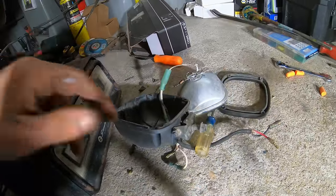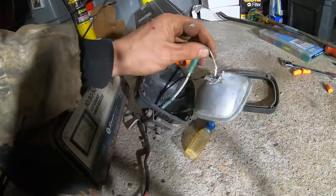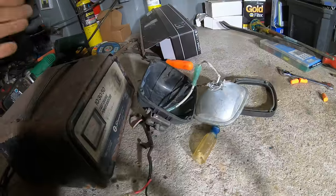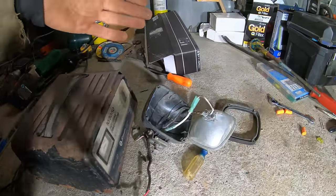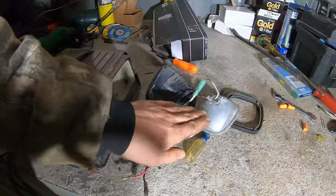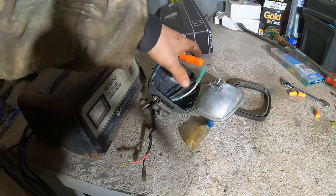That's the purpose of that fuse, is to protect that from happening. If there was no fuse there, what would happen is wherever the thinnest part of wire is would heat up and catch on fire. And that's the same reason you wouldn't want to put a 30 amp fuse in there too, because, well, that was like a direct short, and you could tell by that amp gauge, we were up over 50 amps to make that short happen. But that's the point of a fuse.